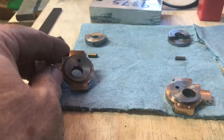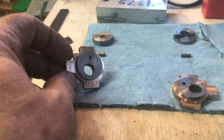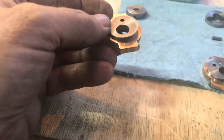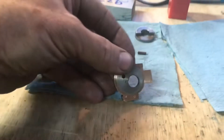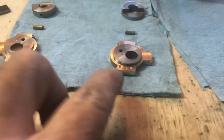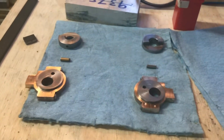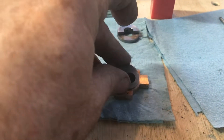It's the end of a beautiful day. I've been out here all day with basically a short break for lunch — I hate to say it but it's taken a number of hours, though it has been enjoyable working on these. I stamped them because I made the pairs to fit — a little number 2 with my 1/16th inch number stamps, so if I take them apart I'll know which one goes with which. I'm glad I didn't have the Loctite in the pins done yet, because it really facilitated testing the fit of the eccentric pins and straps as I was machining them.